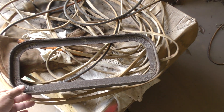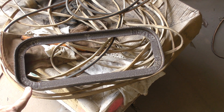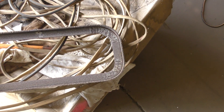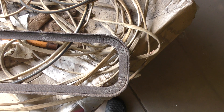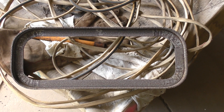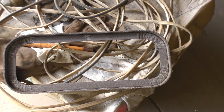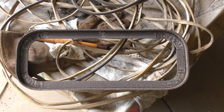Mid to late last year I did start making the frames for those four rear port lights. My first lot of frames for the cabin area went really well, but these ones have actually changed shape quite a bit from welding — the corners have pulled in. I've made all four of them but they've all gone out of shape the same way, so I'm going to have to cut and rework them to get a proper rectangular shape. It won't be too much of a problem — a bit of mucking around over a weekend — and then I'll start fitting them into the sides of the hull under the poop deck.